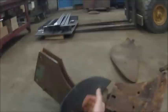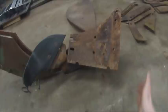And then, it's hard to see because it's so worn out, but this is what's known as a cover board, which takes any dirt that rolls up over top of the moldboard and throws it back down ahead of the soil that's being turned over, so that if you got any trash riding up or anything like that, it will throw it in the furrow and get it turned on all the way underneath.